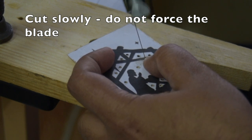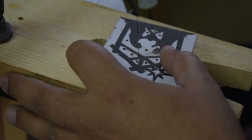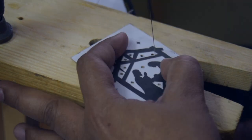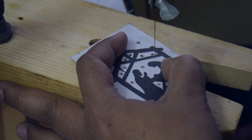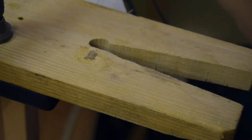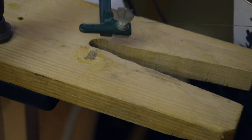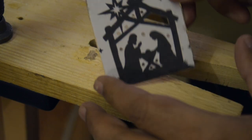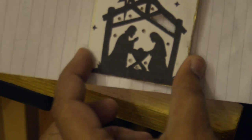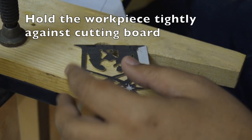If you try to force your blade on the work piece your blade will break, because this is a very thin blade. Corners are a little difficult, so you have to move it little at a time until you have reached the other line. I am almost done — a few more strokes and I will have this piece off. Please remember to remove the blade — you have to unscrew at one of the ends and take the blade out from your work piece. This is a step you have to repeat again and again.